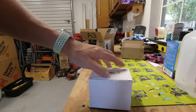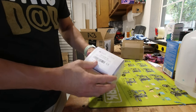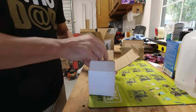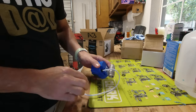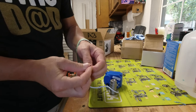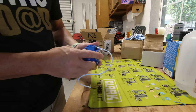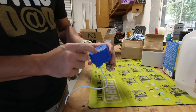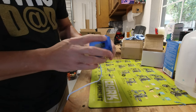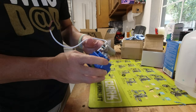So here we've got a US Solid remote control valve. It's a two-wire — you've got your ground and your positive. It is a quarter inch MPT, US Solid. It's very small, probably two and a half inches by three and a half inches in diameter.